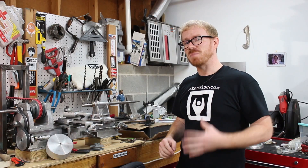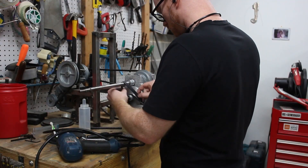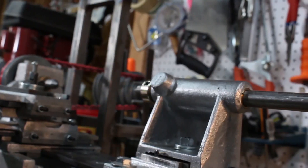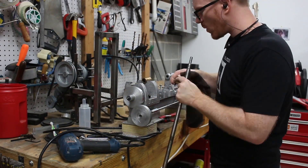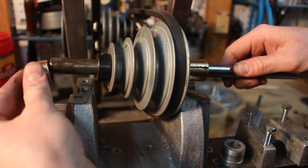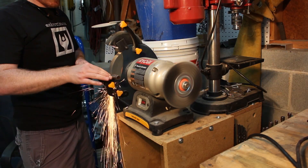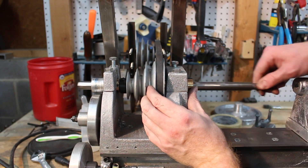I have pretty much two spindles that I've been using, and they're both 5/8 inch cold-drawn steel rod. One spindle has the boring bar, and the other spindle has my turning mandrels. I turned down points on the other end of these spindles so I didn't have to use extra stock for centers for the lathe. I was disassembling the entire headstock to swap out the spindles, but eventually I discovered I could just slide it through much easier.